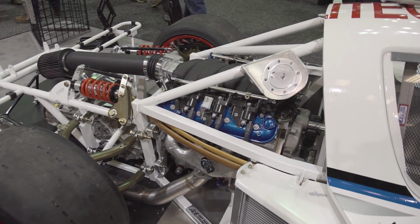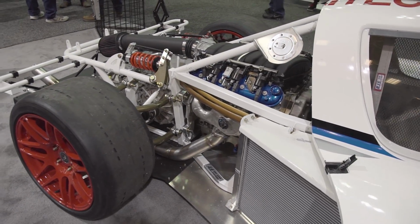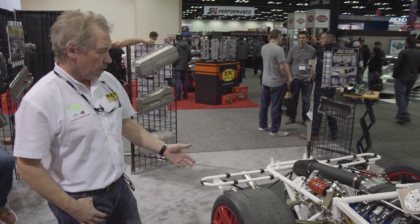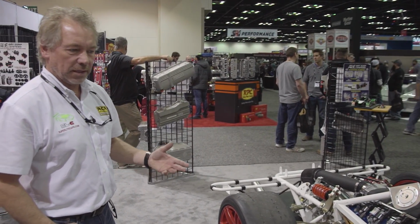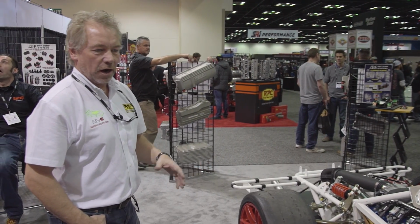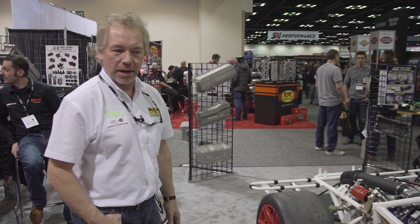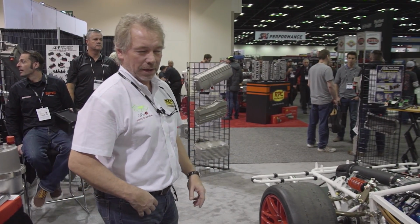too much noise. The chassis on this car is all steel, drawn over mandrel seamless tubing. We have 4 piston brakes on the rear and 6 piston brakes on the front, 18-inch wheels all the way around. This car is designed to have 1,000 pounds of downforce at 125 miles an hour. We can package a 6'5" tall driver, so we can get the big guys and the small guys.